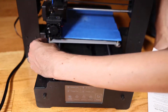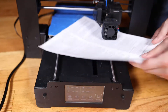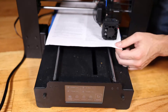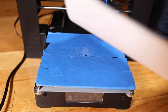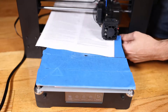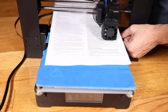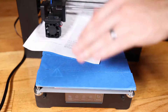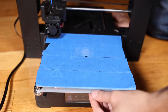I'm going lefty-loosey until it's getting tight. Maybe a little too tight, so I'll adjust it slightly, slide over to the next corner, and feel it — too loose. So now I'm going lefty-loosey to raise the bed up until I feel that bit of grip on the paper. I slide the bed forward and repeat — it's a pretty repetitive process. Still adjusting: this one's a little too tight, so I'm going righty-tighty to pull the bed down. There we go — the bed should be level.